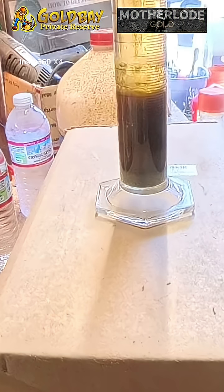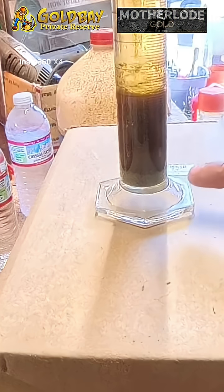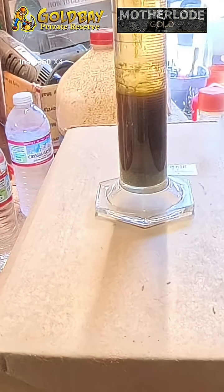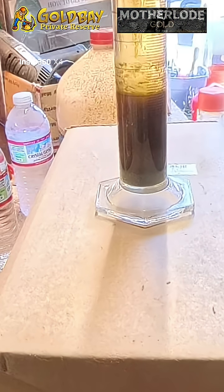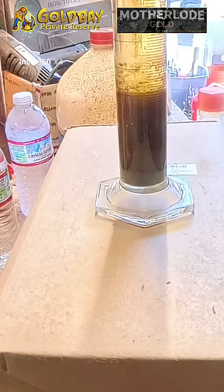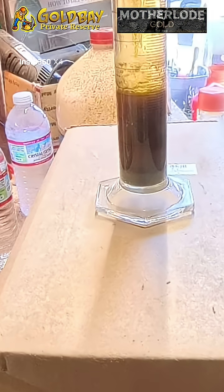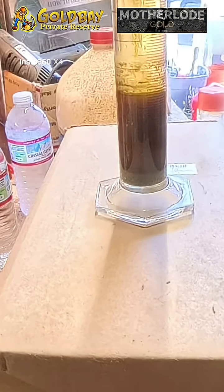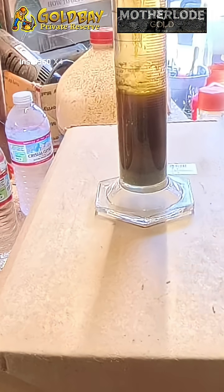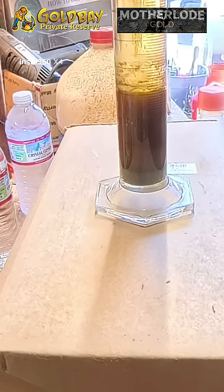One of the things I'm watching for is white silver chloride forming, and I'm not seeing any. So that means I've stripped off enough of the silver. Because when you're using aqua regia, if you have anywhere from 10 to 15 to 18% silver in your naturally occurring gold, the hydrochloric acid will form silver chloride around the gold — it'll encapsulate it and stop the chemical reaction. I'm not seeing silver chloride, which means this stuff will refine really easy.